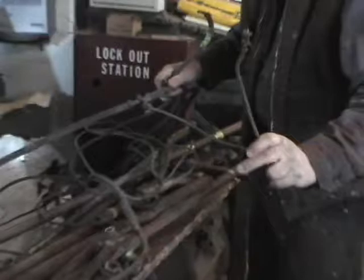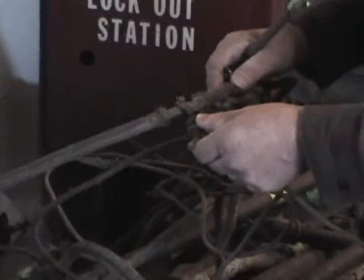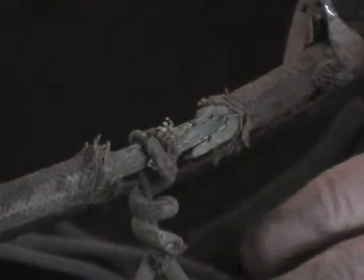It was just wrapped — this is heavy solid wire, not flexible at all. I think it was something they must have done at the very end when they were running out of money. They just wrapped the wire around. What we will do is what they did originally on the car: a T-splice, soldered, with much more wrapping. It'll conduct the electricity much better and more dependably.